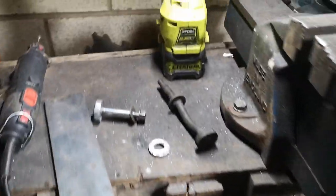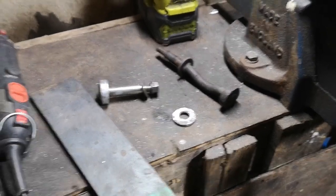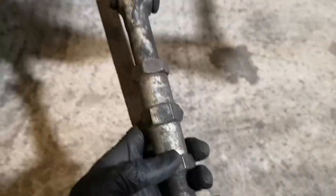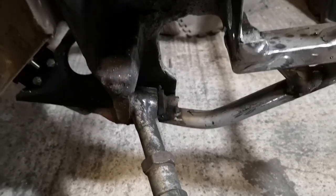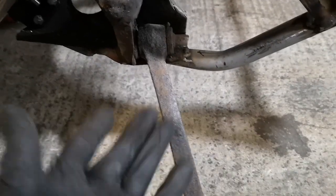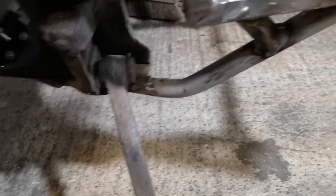So we've been looking for a solution to the suspension pin — it goes on the lower arm inside. It goes here basically, so obviously that's no good. This is our uprated modified arm, and it will sit in there like that. But I'm going to put a plate here. I was looking at using just a bolt, but they're funky sizes being Mini, and I couldn't see me machining bushes down — and if I have to replace a bush, that'd be a pig.